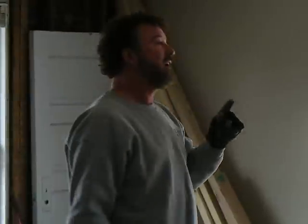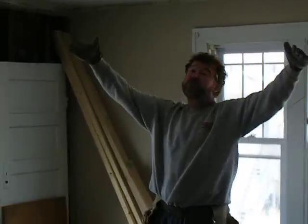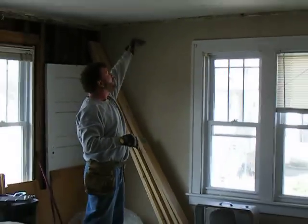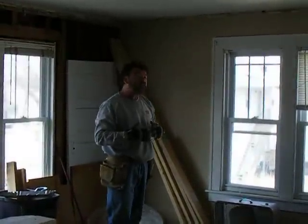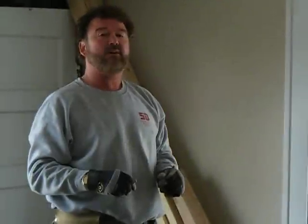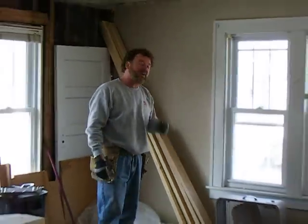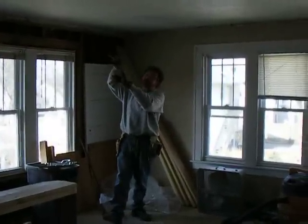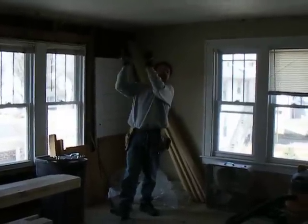Some people don't realize what the contractor has to go through. This has a hip roof, so there's an angle on the roof this way and an angle in these two directions as well. These boards had to get way out there to the roof line where it just about meets the house. Carl and I were on our bellies in the insulation installing these things — that's one of the least popular jobs in construction. We went in there, fastened them in, and sistered them up to the two-by-fours that were sagging. Because they're two-by-sixes, they're holding everything up.